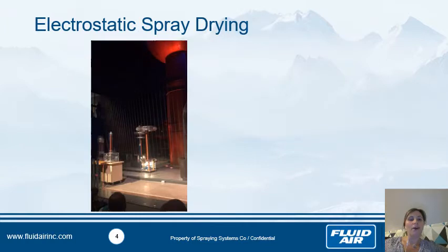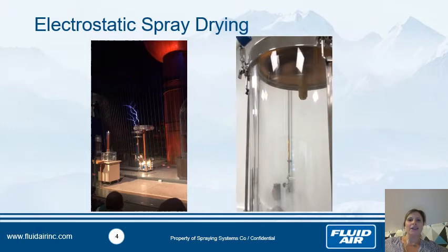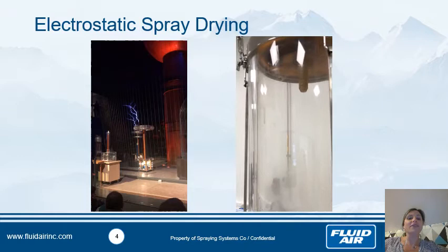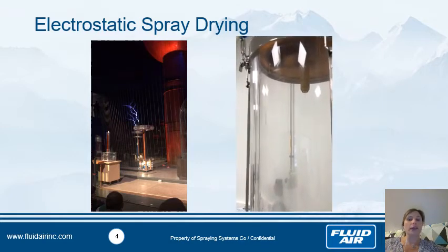To be honest, my first impression when I saw this electrostatic spray dryer was that it would be really noisy. But to be honest, it's not noisy — though we can imagine that in the droplets something really interesting is happening. So just to show you what an electrostatic spray dryer is: here you can see the nozzle, a two-fluid nozzle where we apply an electrostatic charge. We spray the solution in a tower like a conventional spray dryer and obtain dried droplets.